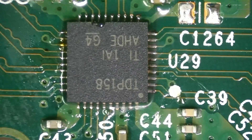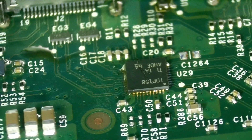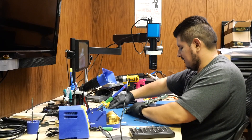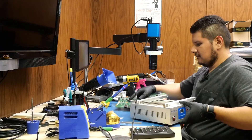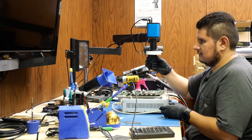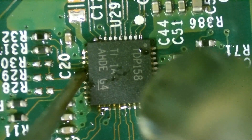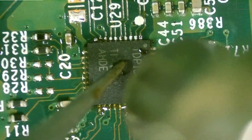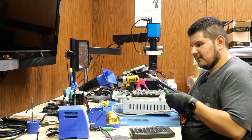We'll find out if it aligns properly. The alignment looks good. It's probably going to be one of those times where I'll want to use bottom heat. I've elected to use some bottom heat, so we're going to go ahead and wait for this to heat up and see what happens. Looks like we're going to have to add more solder to this guy, so we'll swap out tips and get that going.